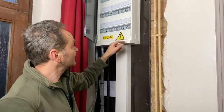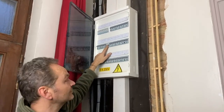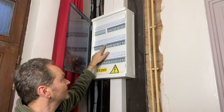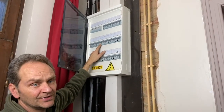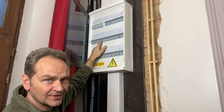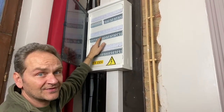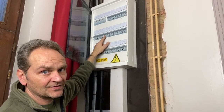So now that we have installed the lamps, we will again open the power in this light circuit. So I'm putting this up, and if this part would not be holding like this, if it's getting out automatically, it is that we made a mistake in the way that we put the wires inside the lamps, because there's a short circuit.